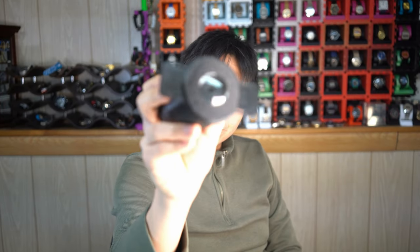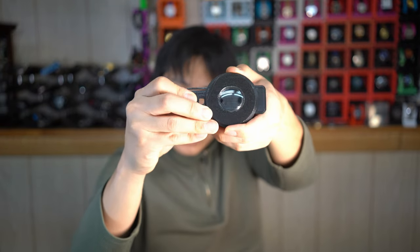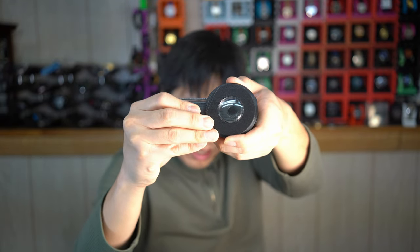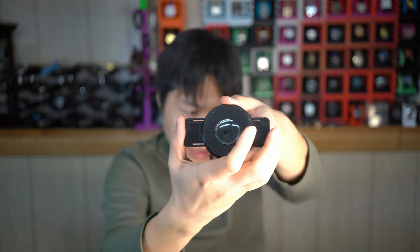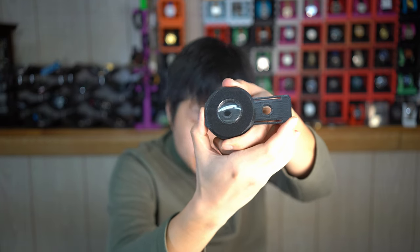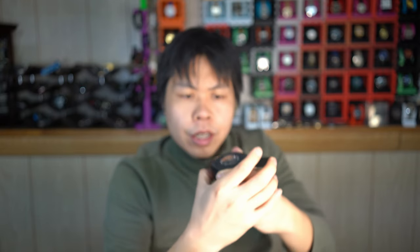You may have noticed when I'm holding this up there are some weird dangly bits on the side — this is actually my attempt at designing variable aperture. If I slide the plastic piece over, different diameter holes are cut out between the lens elements. I chose the diameters based on what Polaroid had already done with the land cameras, where the largest opening is roughly equivalent to F8.8 and then stopped down from there.